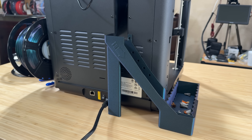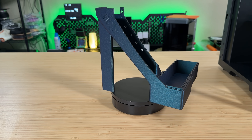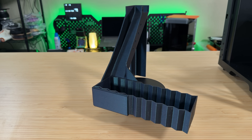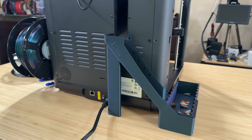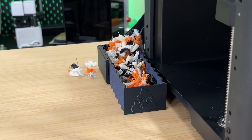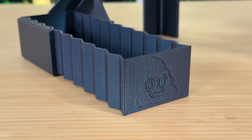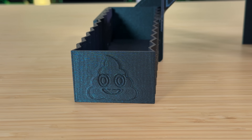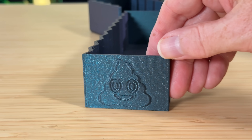Like other single-nozzle multi-color printers, this printer produces purge pellets, so I needed something to direct those to the side where I could collect them. I grabbed a poop chute from FlashForge's site and printed it using standard settings at 0.2 millimeter layer height — print time was just over seven hours, in FlashForge's Burnt Titanium PLA, a dark blue with some glitter mixed in. It works great at directing the purge waste into the bin, but if you're printing something with a lot of color changes, you might find yourself emptying it every hour or two. As far as print quality goes, there are some ripples in the surface finish and a bit of cobwebby stringing in the zigzag section, but since this is meant to be a functional print, I'm not super concerned about that.